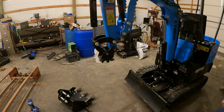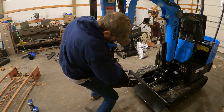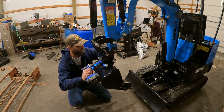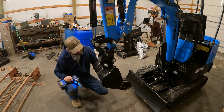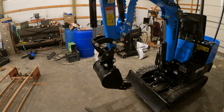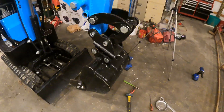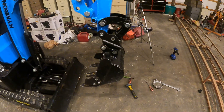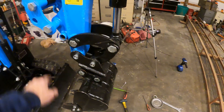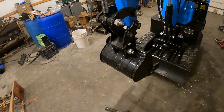Now that we've got that sorted out, we will set this bucket on — away we go — like so. Voilà, ta-da! Awesome, that'll work. Now I have a quick attach, pretty simple to put in. I went ahead and picked this up when I bought this, so I can just take my impact and put that on there. That was a 21 millimeter. Like I said, when you take them off, just pay attention — keep your pins to the hole they come out of. Once I did that, they fell right in.